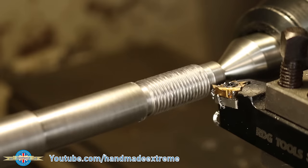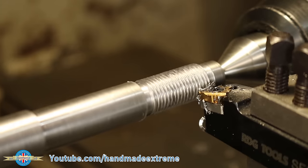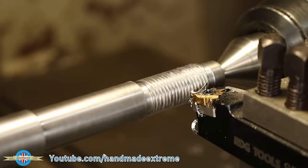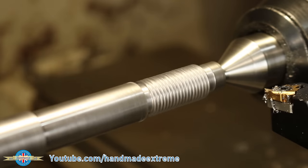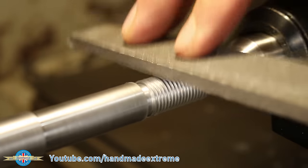Disengage. We'll just take a couple of finishing passes now, only taking a little bit off just to smooth up the surface and make a nice finished thread. A little bit of emery paper and a bit of Scotch-Brite at the end helps to clean up the threads and get rid of tool marks. A small toothbrush or wire brush is really good for cleaning the little bits of swarf out of the threads before you test fit your nut.